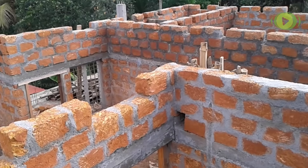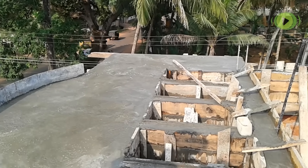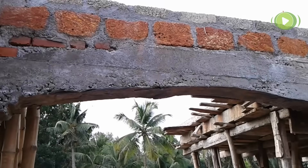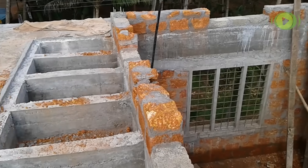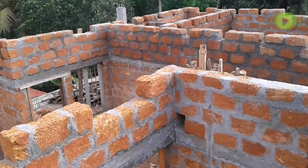After removal of the side shutter, laterite works can be continued up to the roof level. At 2.4 meter level there is an extra structure of pergolas and small slabs on the second floor, which were constructed. The height of one floor is 3.06 meters, so laterite works are done to this level, with small spaces left above for air.